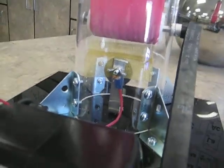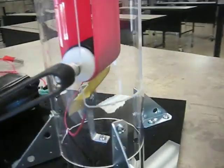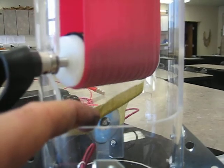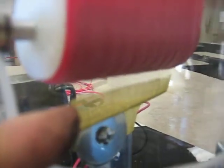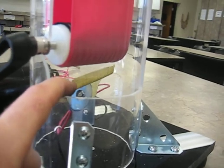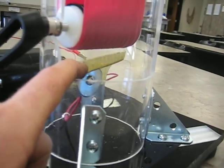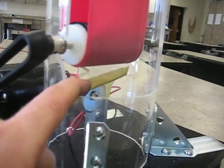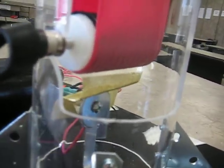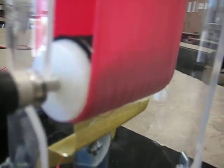While we're down here, one quick thing about the combs: the combs do not touch the belt — they sit about a quarter-inch away, though the closer the better. One important thing is you're going to want to peel one of the little strips off the brass so that the comb will have little nubs pointing up toward the belt. If it doesn't have a point, it won't be able to produce the charge properly, so make sure you have that pointed in.